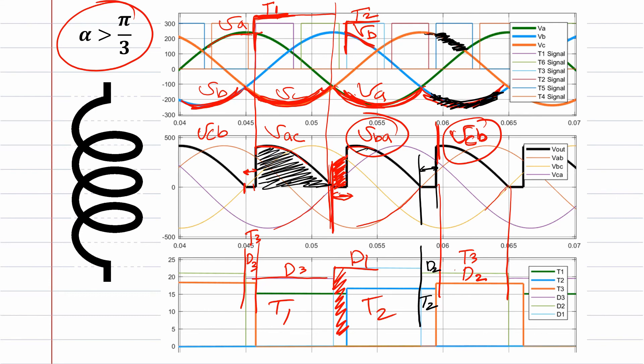To calculate the average voltage, you can find this portion and integrate without any problem — we obtained this before so no need to repeat. The key difference is that with an inductive load we expect the output to go negative, but here it doesn't — because the half-controlled rectifier's lower side is not a controlled rectifier but a diode rectifier. So the lower side is always ready to conduct once one voltage is smaller than another. I hope you enjoyed this lecture and I'll see you next time.